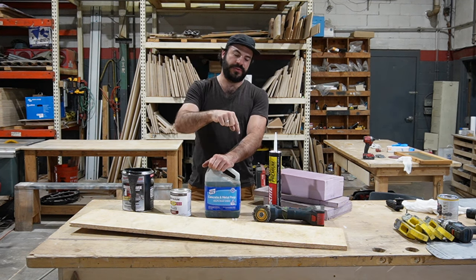The other drawback to welding the hole shut is that when you do that, it looks great on top and you might paint it and do all that, but unless you go underneath, anywhere that you've welded, not only do you have the weld, which is just new bare steel, but you probably burned off all of the undercoating around that. So you need to go underneath and apply some type of undercoating or paint. Otherwise, you've just introduced maybe 80 places where you can now get rust on bare steel.